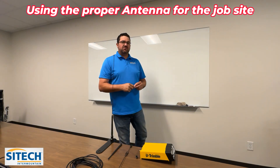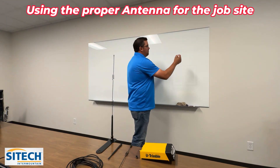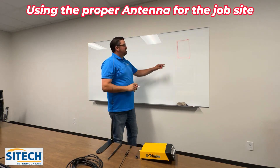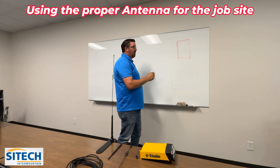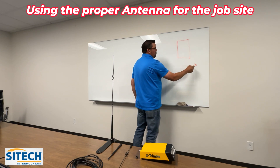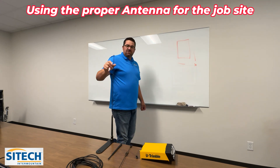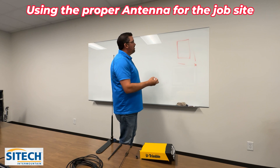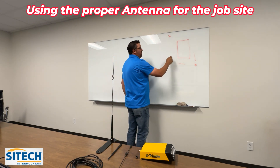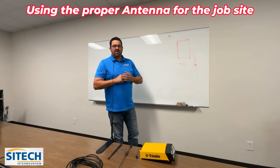We're also going to talk about certain things that will affect your base antenna signal. For example, on a job site with a big concrete tilt-up building, those big tall ones affect your antenna strength a lot and there's sometimes not much you can do about it. If you had your base on one corner and you're trying to bounce that signal over to machines working on the other side, even the big antenna or the small one may not get it there. You may need another base location or a repeater, because that concrete structure is going to affect your antenna signal no matter which one you use.